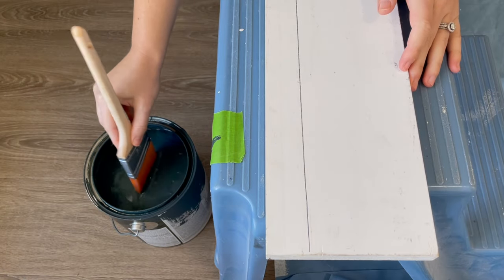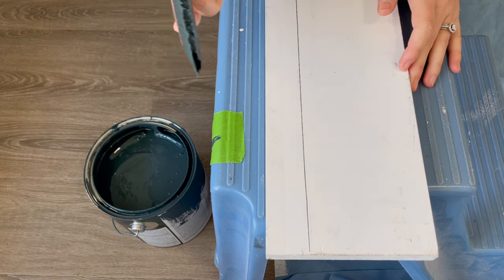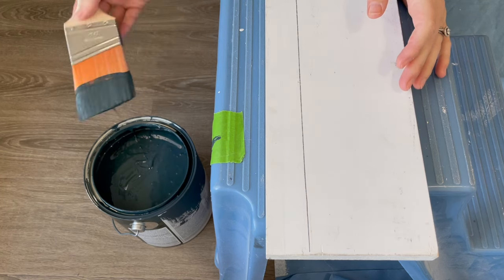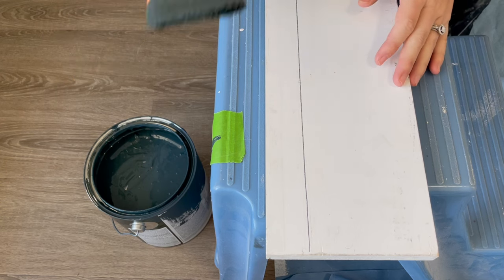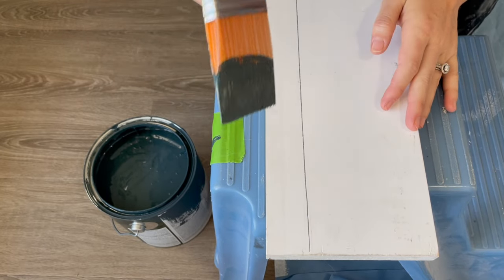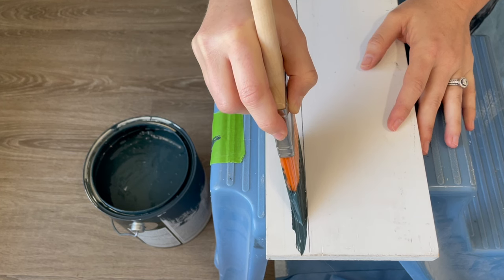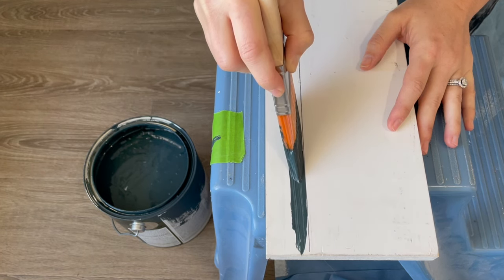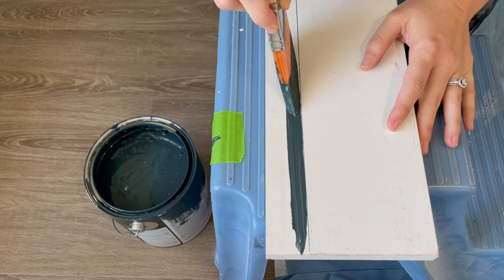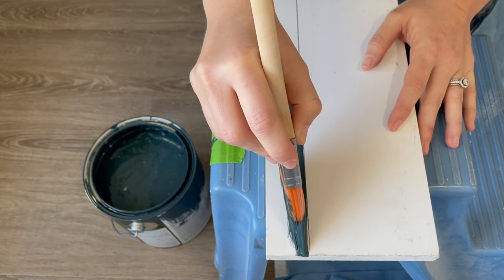When I dip my paintbrush into my paint I'm pulling the paint off the two sides of the brush — it's okay if you have a little bit of paint still on the tip, but I want a lot of it off the sides. The key to this is starting just a hair off the line, then starting to push and drag the brush, and as I'm dragging I'm going to bring it closer to the line. So you can see I'm starting off the line and then as I pull down and drag I'm bringing my bristles right to the edge, and if I feel like I'm starting to lose paint or get off track I sweep away from my line and then come back and do it again.